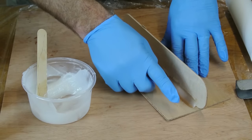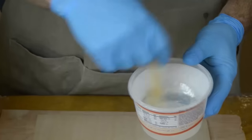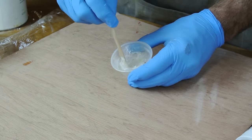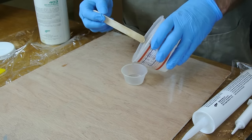Epoxy can be used to create strong joints with a process called filleting. A fillet is a bead of thickened epoxy which covers the seam where two plywood pieces intersect. To create a fillet, you will first need to thicken your epoxy. This strengthens the epoxy and ensures that the fillet holds the proper shape after being applied. Begin by mixing a normal batch of epoxy, then add the thickening agent a little bit at a time, mixing it into the epoxy as you go. Continue thickening the epoxy until it has reached the consistency of peanut butter. If you add too much thickener and your mixture becomes dry, simply add more unthickened epoxy. Once the epoxy is thickened, it is time to spread it onto the joint.